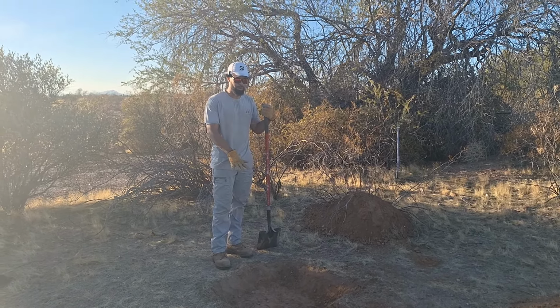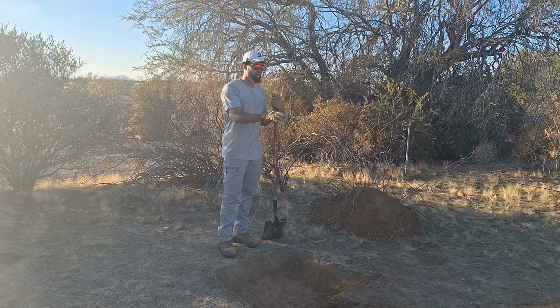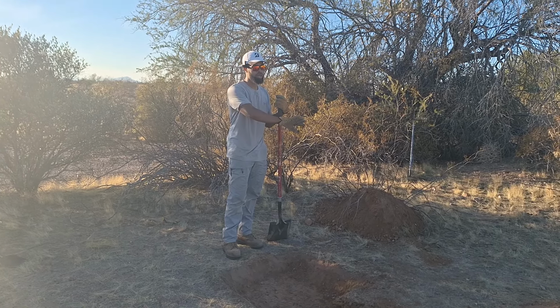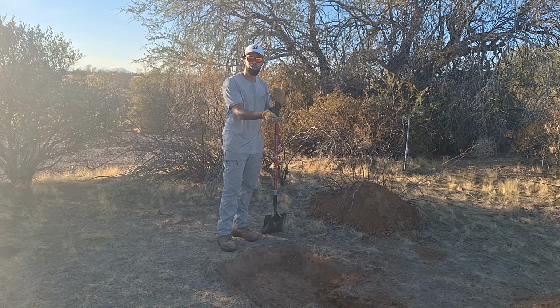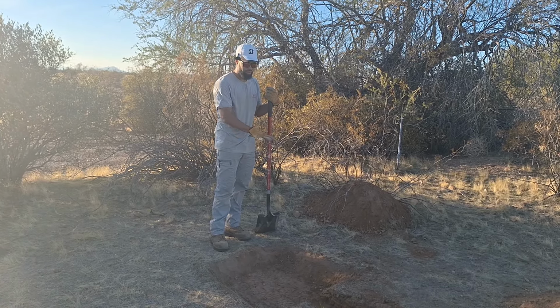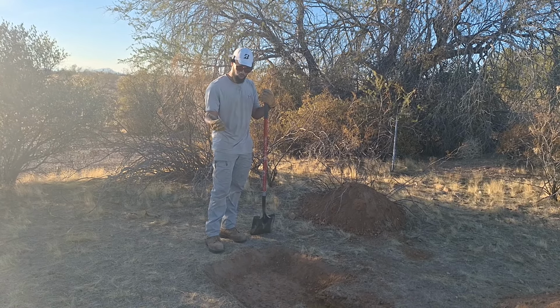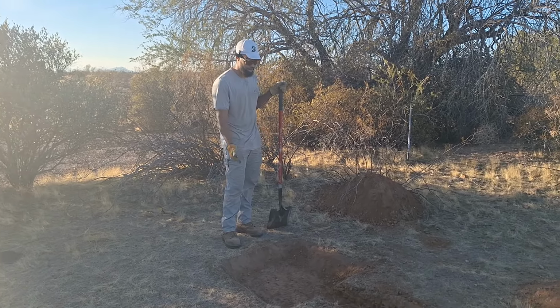And we got all those bags full of rocks over there. That's how this is going to happen. We're going to put down cloth and then rock on top. Staple the cloth to the rocks on the trench side. Fill it with dirt. So that leaves the void in the middle for the water to travel through the rocks. Here, we're just going to leave the rocks exposed and the cloth off to the side so that the water as it comes down doesn't erode the sides into the rocks.